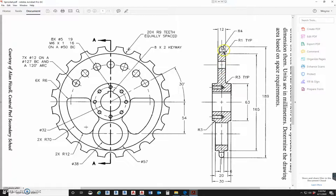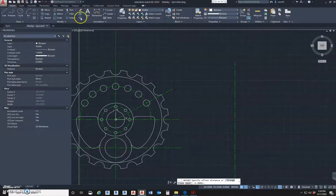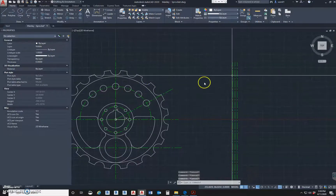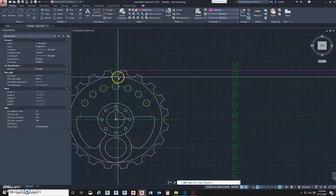We're going to start up here and work our way down. This little arc here is 4, and remember the top of this is 189, so it's at the top. We're just going to project lines over — that dark line is the bottom of the tooth, and this little shoulder is where there's a hole. We'll project that over. We're going to copy that, and that radius was 4 for the top little sprocket, so we type in 4. Now I'm going to change to projection lines and use Ray — ray should be at the top of the circle.